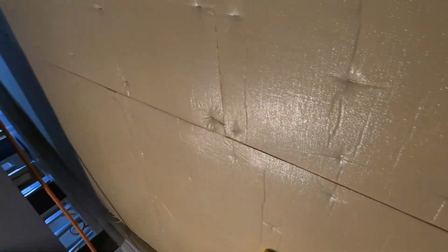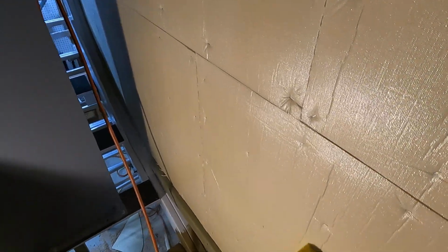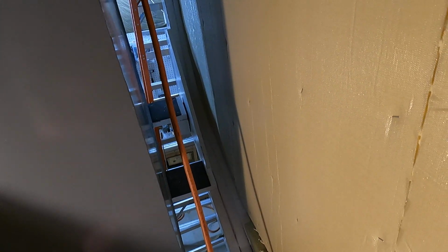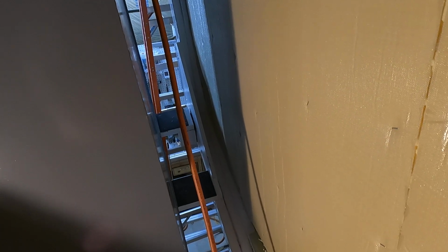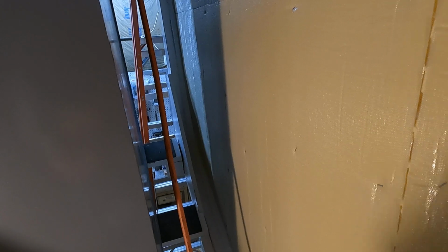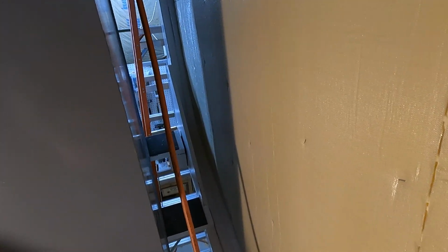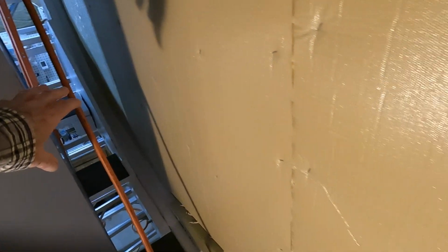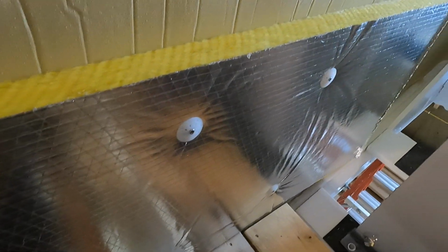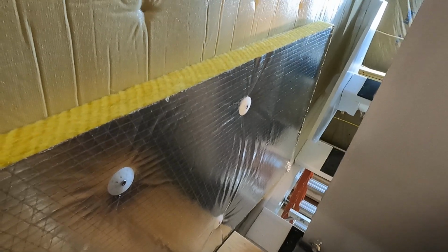And again, I need to get the North Sea exhaust system that I'm planning on putting in mounted just above that support for the tank over there, to get it above the water line, somewhere in the upper half of that gusset there in the corner. So there will be a T right in here, and then the exhaust will go out either side. So I need to leave room for that.